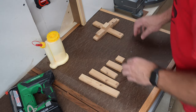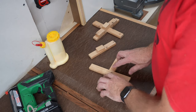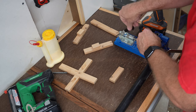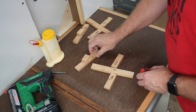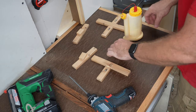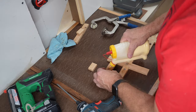Now we need something for the tree to stand in. You can get creative and make any kind of stand you want. I'm going with a simple cross pattern. Then we need to make pocket holes to attach these pieces together. Set your pocket hole jig to a half inch, and we're going to be using one-inch pocket hole screws. If you don't have a pocket hole jig, you can fix that by clicking the link in the description. They're super handy to have if you're going to be screwing pieces of wood together.